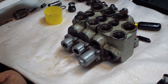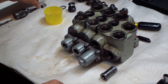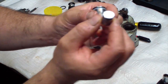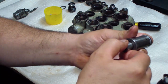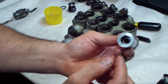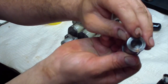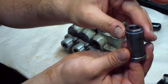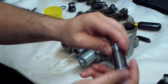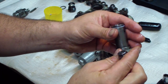and the way it goes, this part goes like this, then this part inside. I did have to lap this one inside. I put it in, and then I use a hose to hold this part in. And then I put some lapping compound around the ring where they mate, and with a drill I lap it in, so now I have a very smooth surface and a good mating surface. It's not supposed to leak,